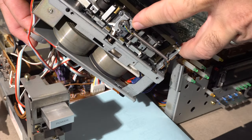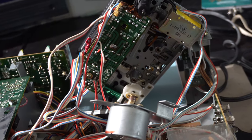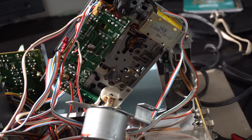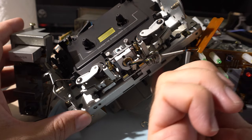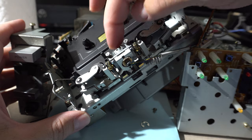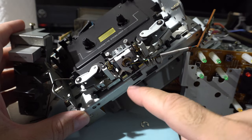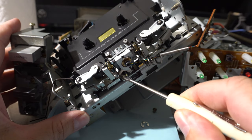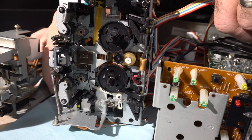There were screws along the top and bottom. I removed the flywheels to clean them. At the back of the mechanism there's a white anchor-shaped gear — that's what causes the head to flip back and forth. Manually turning another gear, you can see the head moving to reverse. The anchor-shaped gear was getting stuck against one side and wasn't pressing down enough to clear an obstruction. I oiled and lubricated it and got the head to turn all the way in both directions.